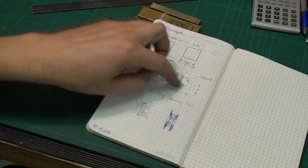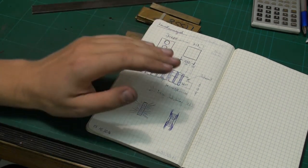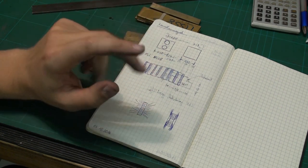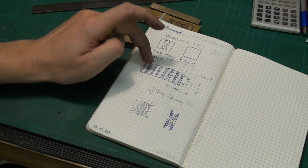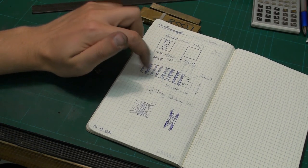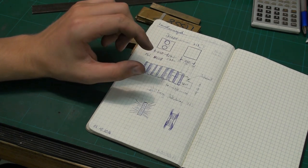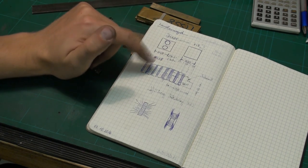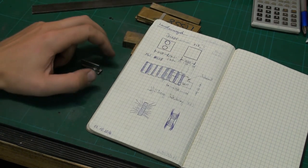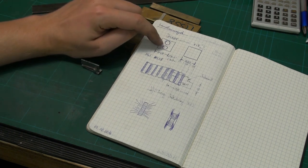And then we'll stack up and we will glue it all together and machine and surface grind it all over, which is not a problem because there is no exposed magnet to the outside. We only have the brass plates between and the brass plates with the magnets in them and the mild steel pole plate between them.